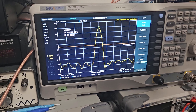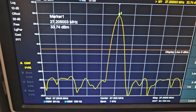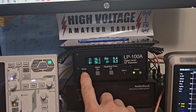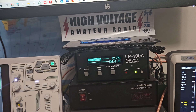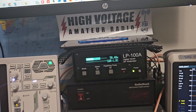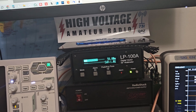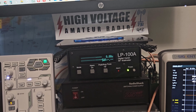Here's the TX frequency of this radio. We're in service mode with one kilohertz resolution — pretty darn good, can't complain. Now looking at FM power: this one is about 39.5 watts, so I'm going to turn that up to 50 or somewhere around there. I don't really recommend running it that hard all the time, but on FM it's a consistent power level and 50 watts is strong — it's a lot different than AM.